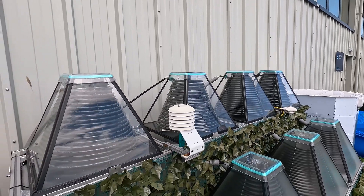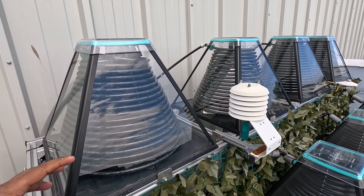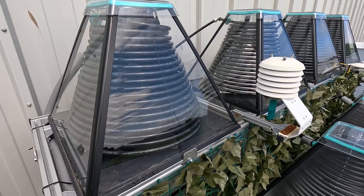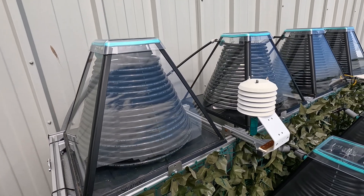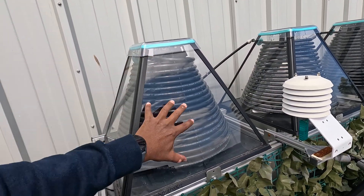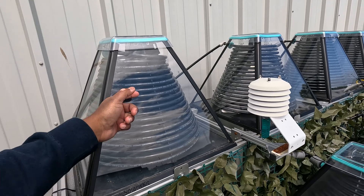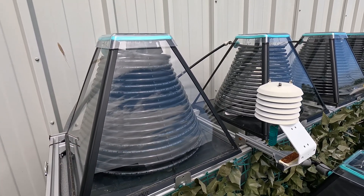The alternative is to use our solar collectors. At SolarisKit we've developed a new prismatic shaped solar collector which you can see here. They're shipped out as a flat-packed kit and you assemble them in around 30 minutes without any tools. Each collector is about 54 centimeters by 54 centimeters across and about half a meter in height, so they're pretty compact. The coil inside the prism absorbs sunlight and becomes really hot — those coils can get up to about 80 degrees Celsius — and then we simply circulate water from the hot tub through the solar collector to heat it.